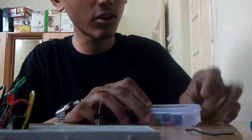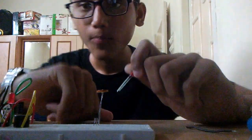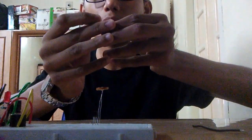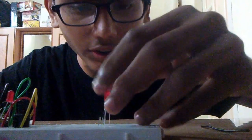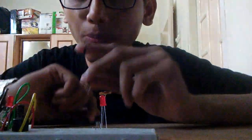We'll also need an LED — we can use a red LED or even a buzzer. This is an NPN transistor. In an NPN transistor, N refers to the negative side with electrons, and P refers to holes on the positive side. The LED has two legs: the shorter one is negative and the longer one is positive. Connect the negative leg to the emitter of the transistor.